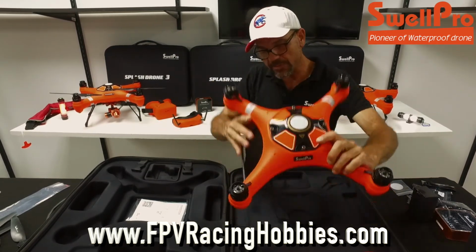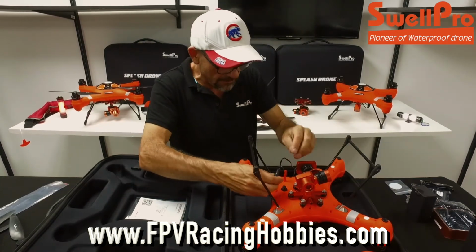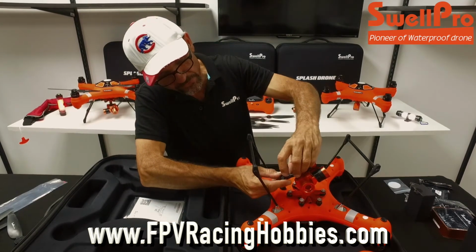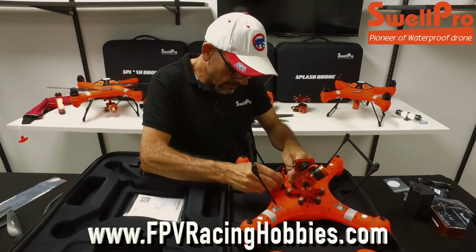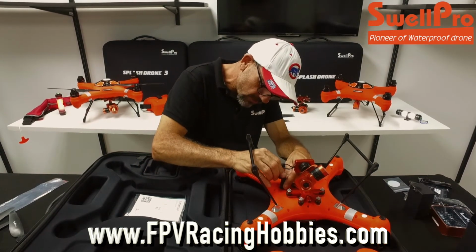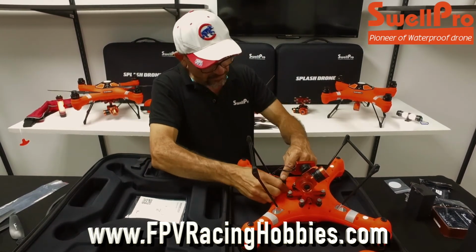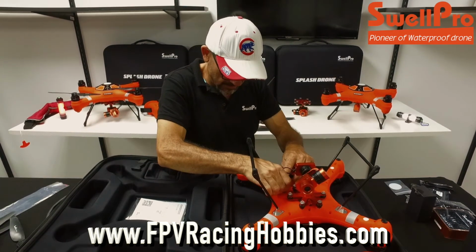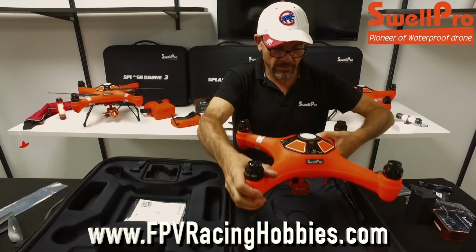I'll plug it in now for the initial startup. But when we do a calibration, we're gonna unplug it so it's not bopping all over the place. Look at the pin orientation and the little slot, and then find it here and plug it in. Feel it. Don't twist it around too much. Try to really find it without twisting so you don't bend the pins. Push it down. You'll see. Feel it insert pretty well, and then just tighten this up and snug it. And that's good. Okay. So, there we go.